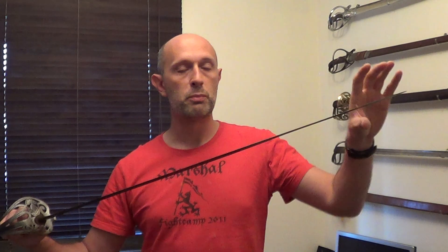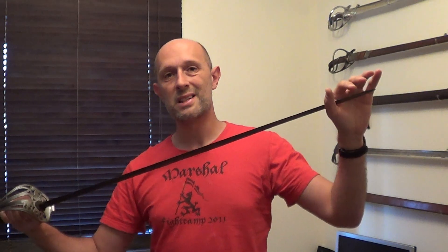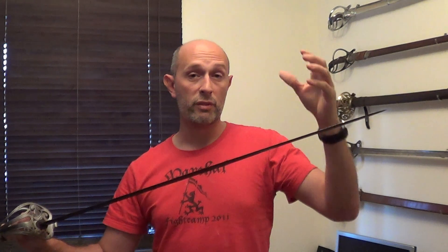Not all swords are made like that. In Europe and parts of China and most of Asia, mono-steel was used for sword blades, certainly in the last few centuries. The mono-steel was hardened — that is quenched — and then tempered, that is taken to the kind of blue colour and then allowed to cool slowly. That results in essentially a leaf spring, a sprung steel blade. The reason for doing this is you're making the blade hard at the edge, whilst making it flexible rather than brittle like glass. You're introducing springiness to the blade so that it can survive the rigours of combat — hitting and stabbing into opponents, shields, and armour — but also in defence, absorbing blows, parrying, and deflecting other blades and weapons.